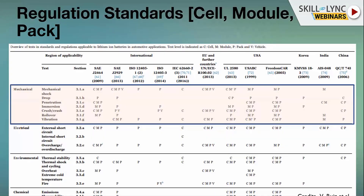This slide highlights the regulations in place. The blue rectangular box shows mechanical requirements — C means cell, M means module, P means pack, V means vehicle level. Countries like the USA, China, and European nations have put forth stringent requirements; India also has regulations for cell and module. Predominantly these cover mechanical shock, drop, and penetration. Penetration is a critical safety requirement — if a protruding part from a crash penetrates the battery pack, the pack must not explode or cause electrocution.